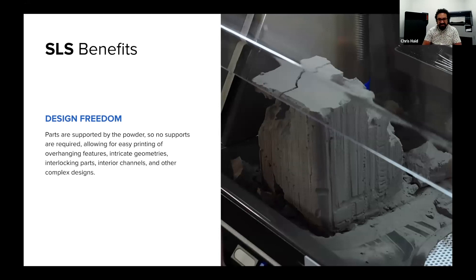Due to the nature of the process, all of our parts are suspended in this powder cake that we have to pull our parts out of at the end. What this means is that we don't have any mechanically attached support structures that we need to clip off or sand down after the process. We do have a step where we extract our parts from this powder cake, which is a little bit of work, but with brushes and a little cleaning we can get a nice professional aesthetic surface without having to do sanding, grinding, and a lot of touch-up machining that you might have to do with other processes.